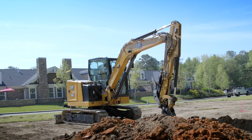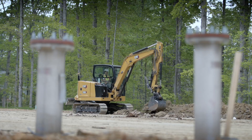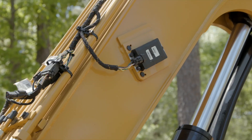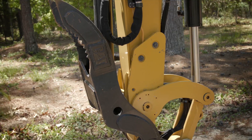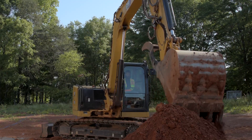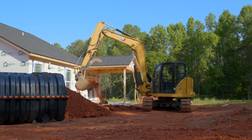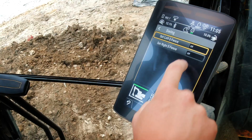Let's review the hardware that makes it work. The Mini Excavator Ease of Use system utilizes a group of sensors to communicate with the machine to acknowledge boom, stick, bucket, boom swing, and house positions in relation to the undercarriage. This information is processed by the machine so that it knows exactly where the linkage and your work tool are located.